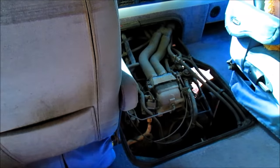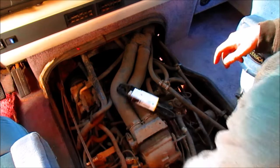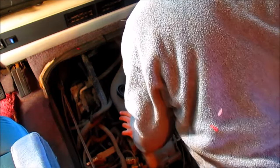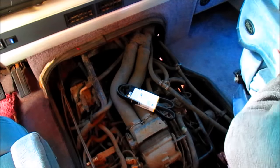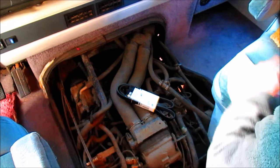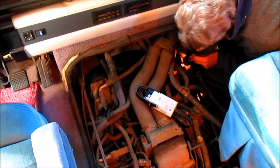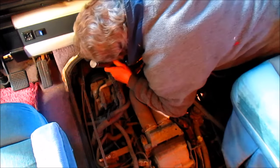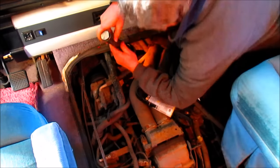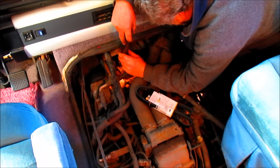This we will take back to the back side of the RV, and we got our new fan belt. But then the question is, where does it go? And I can see the beginning of where it goes. Maybe we can put you back here. Well, actually, I want to be back there now that I'm looking at it. All right, there's an adjusting bolt there. No, that's the pivot bolt. And the adjusting bolt is probably right there. Yes. Fairly easy to get to. It looks like about a 9/16 or a 5/8. And we might just be back in business.